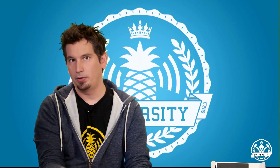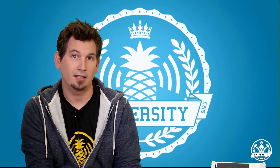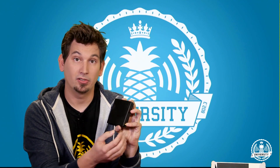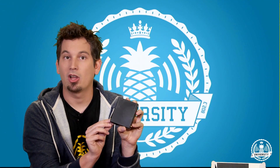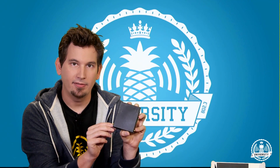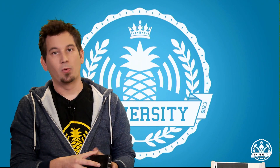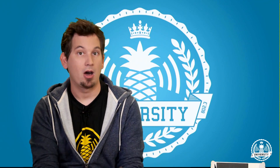To talk briefly about the radios: we put two very powerful, infamous radios within the hacking community inside this device. We have the Atheros AR9331 running radio 0, or WLAN0, which serves as our access point — a very high gain, versatile unlocked radio — as well as an unlocked Realtek RTL8187 as radio 1, or WLAN1, which is useful for connecting to other access points in client mode, sniffing traffic in monitor mode, or advanced attacks using raw frame injection.